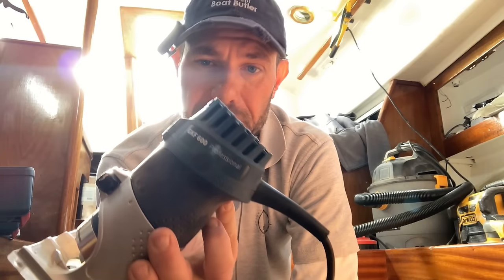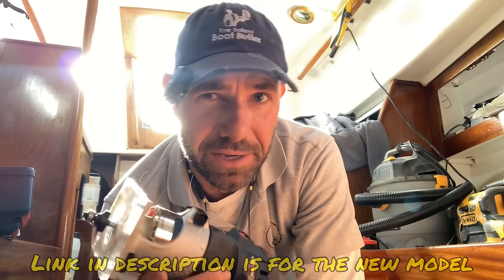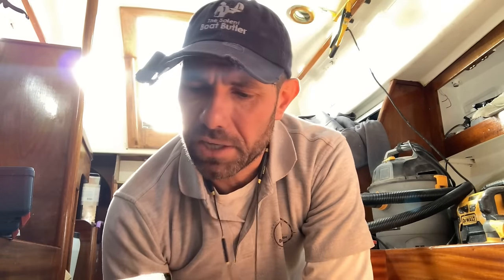If you want one of these, they're really good. Maybe I should put an affiliate link in the description — lots of YouTubers do that sort of thing and it makes them a couple of pence when you buy one. I'm going to try and set up an affiliate link for this router in the description. I've just got to change the bit — hold the little red button to lock the spindle, spanner on, slide the old bit out, slide the new one back in, and do it back up.